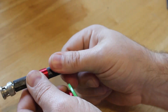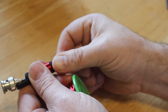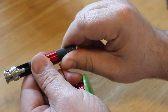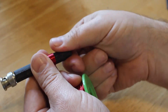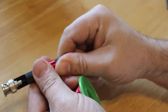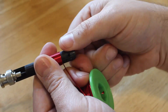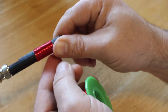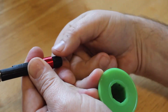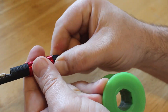I'm doing some educated guessing to figure out the inductance and how many windings I need. It's based on a few variables: the diameter of your core, the thickness of the wire, how many turns you have, and turn spacing — which does make a difference, so I try to cram mine together. If you use smaller wire, you'll have to use lower power, but you might be able to get more windings, which could change the inductance. I think that's how Elecraft does it — they use smaller wire. I've never taken apart one of their AX2s to find out how they make it so small.